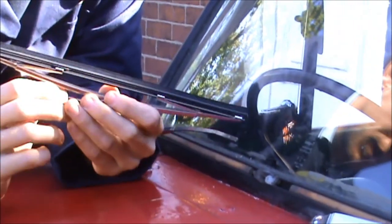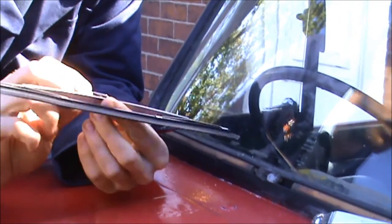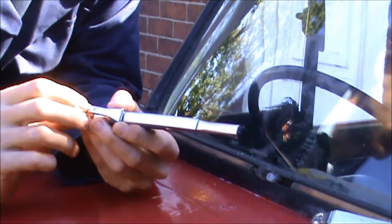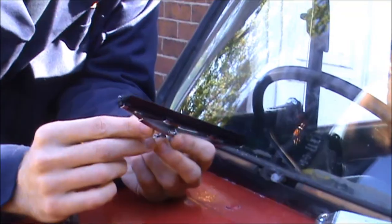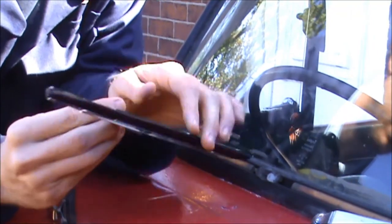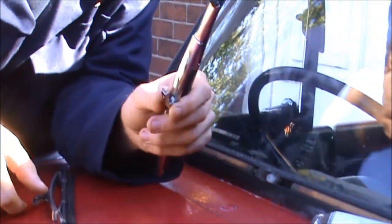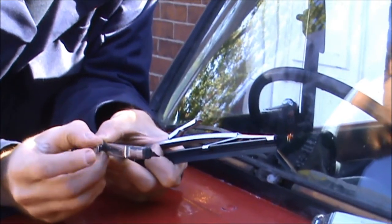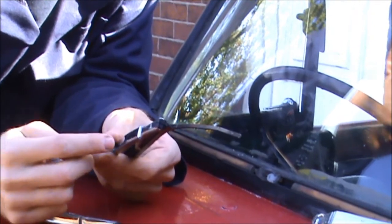So what I might do is make a little modification to it. Where that little catch is underneath, I might just poke that up a little bit or tighten it around a bit more with a pair of pliers. By comparing the two little catches, I can see that the new one is a little bit — actually a lot — looser. The old one is a lot tighter; you can see it's got quite a bit of spring in it. With the new one, there is a spring there but it is quite loose.